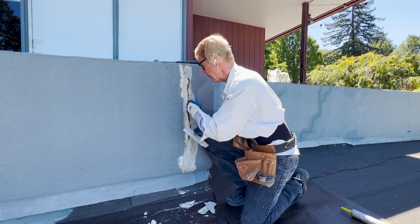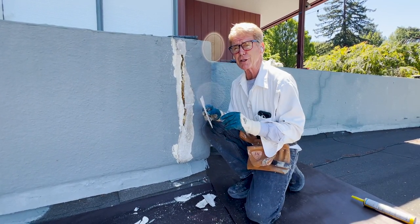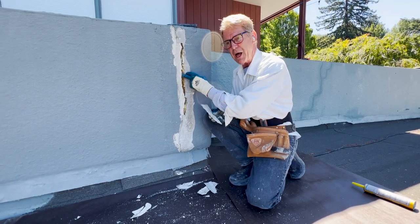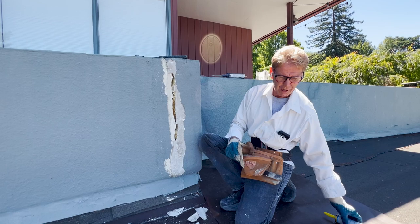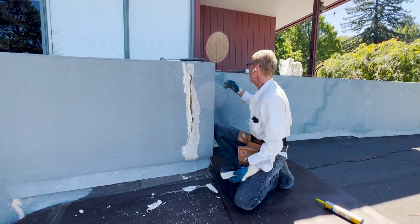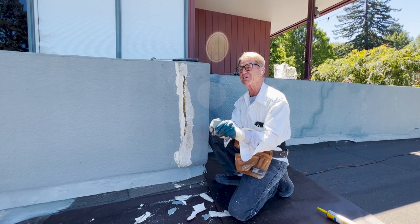What they've done here in the past — you can spray styrofoam in here and once it mushrooms you cut it off and put it back together. They also put a fiberglass mesh tape. Fiberglass mesh tape is for a brown coat when you're getting ready to do your color coat. You put it over your brown coat and those cracks are not supposed to reappear. But when you have a crack this big, that's structural — fiberglass mesh tape will do nothing except re-bust. We're going to tear this all apart. They stuck that styrofoam in there and it expands, then they put on an acrylic finish. If it's brittle like this, it's not really a quality acrylic finish — a quality acrylic finish should flex more.